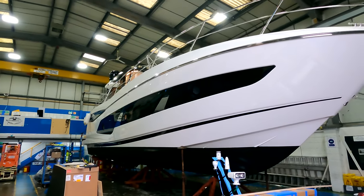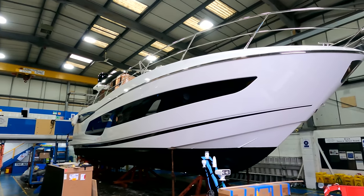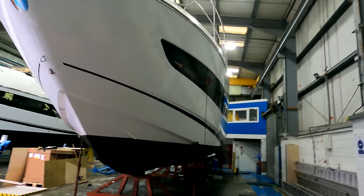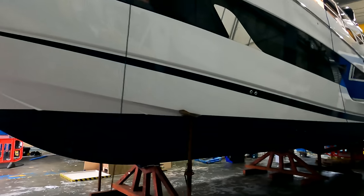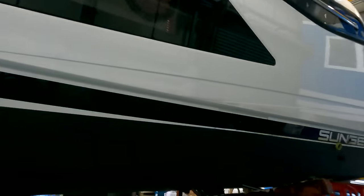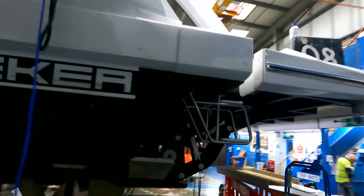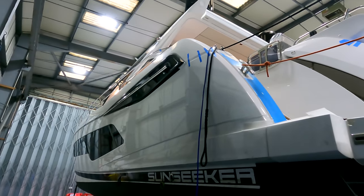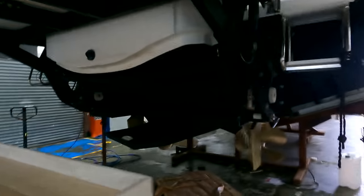This is the boat we saw a couple of weeks back in my preview - that's off to the States. She's about boat 505, just going through some final systems fitting and testing prior to onward shipping. You can obviously see the boat out of the water here. We've got a proportional bow thruster up forward, a classic white with a black boot top stripe as per most Sunseekers built today. There's a hydraulic high-low bathing platform with a 450 kilo lifting capacity, as well as the garage so you can put a jet ski on the back. We've also got a proportional Sleipner stern thruster tucked in there, and an additional section for our stern lift.